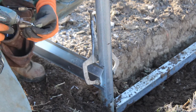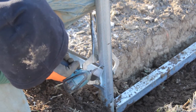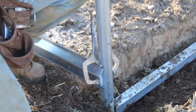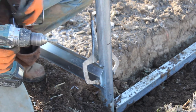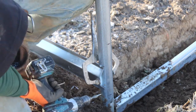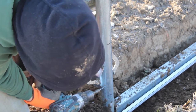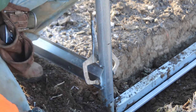Now I'm ready to secure it. You get a pan head screw, which will go in the top lip — it's a self-tapping screw. You want it to be a pan head screw, which means it's not a hex head, essentially it's flatter. You want that because your roll-up side is going to roll right over that screw and you don't want it to be a rough time for that roll-up. Then you take the bottom lip and drive a hex head right through. This particular screw is a three-eighths inch drive, one inch long, and it's a self-tapping screw.